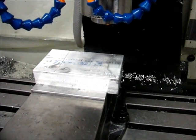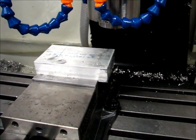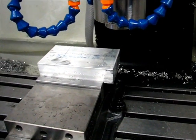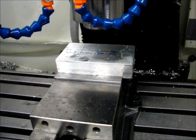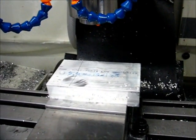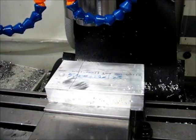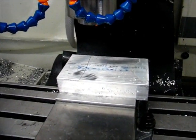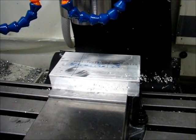The tool I'm going to use is my half-inch three-flute roughing end mill, and I'm going to use that for the whole process. Part of the reason for that is the tool itself has a 20-thousandth chamfer on the tips of the flutes. So when I go with a finished depth of cut less than that, I'm only cutting on the chamfer. The idea there is that I've got a 45-degree angle on it. It's no ball-nose end mill, of course, but the finish is going to be much improved because there won't be any vertical surfaces. I'm expecting furrows between every single layer, so it's not going to be the most amazing thing in the world — it'll take some hand finishing.